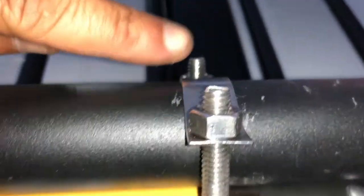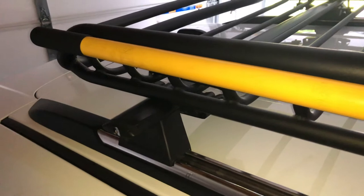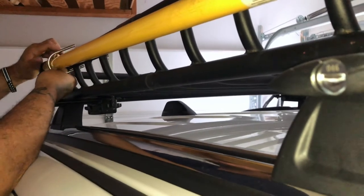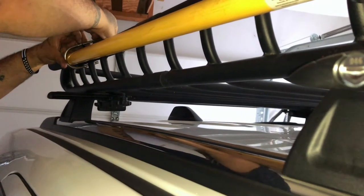You're going to put it around your basket with the flat bar. This flat bar will need to bend — as you can see here, it's bent so you can get a good purchase on your nuts. You're going to put one in the front of the tool and one in the back of the tool, and tighten them down. Take your U-bolt, put it around, then take your flat stock and barely catch the nut — one or two threads at most.